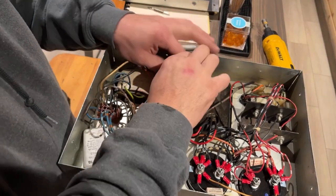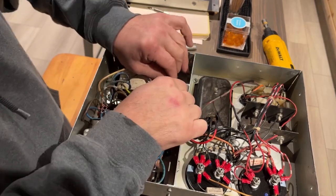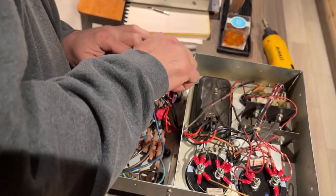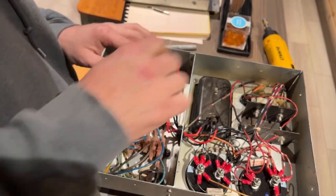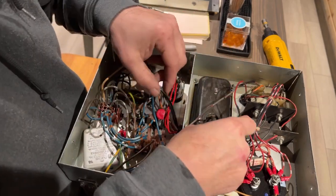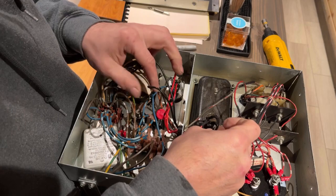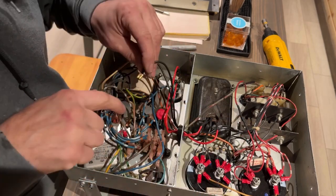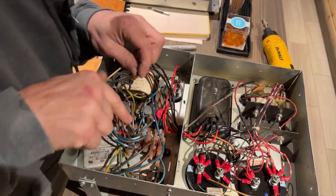So these two blacks got to come off of here. One red from here goes on one side. The other red goes on the other side. So one red here, one red here. Then we have two wires left over. The one to the right here, this one is my brown and white wire that goes over to the brown and white terminal over here,